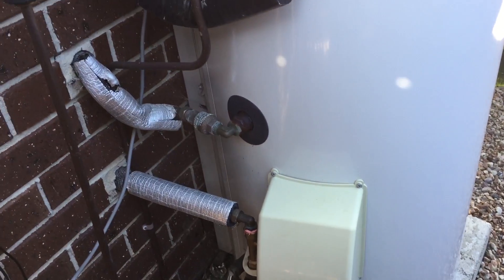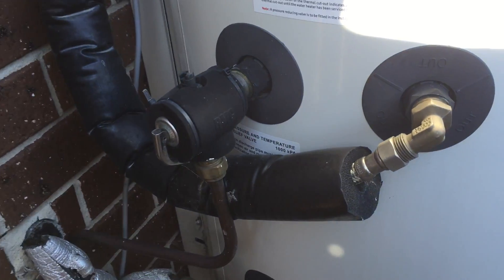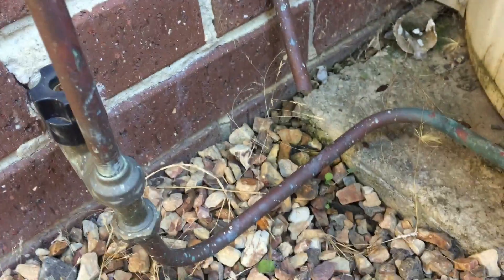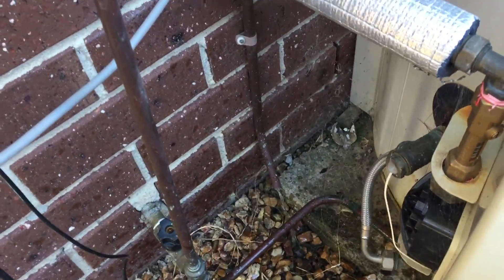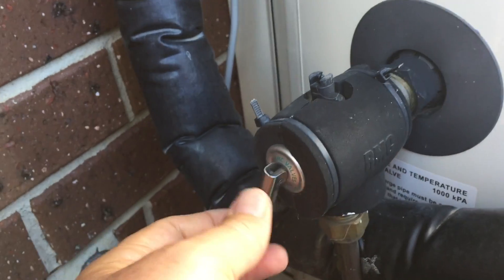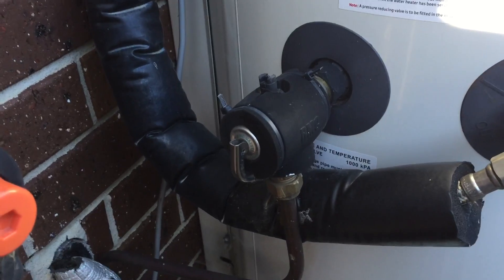And that's a separate system to your actual hot water, like a normal system. These guys up here are your normal hot water system. You've got here this guy - it's just a pressure relief valve. If we let that go and look down there at the bottom, we open that up, you see that hasn't been done for a while. But it says on it that it's good to periodically do that - that's a pressure relief valve. That is there so that if something goes wrong and the tank overheats and there's too much pressure, instead of the tank blowing up, it'll release out there. Just giving that a little bit of a run once a month or something like that - make sure it's open and working - will save your tank from splitting and blowing up.